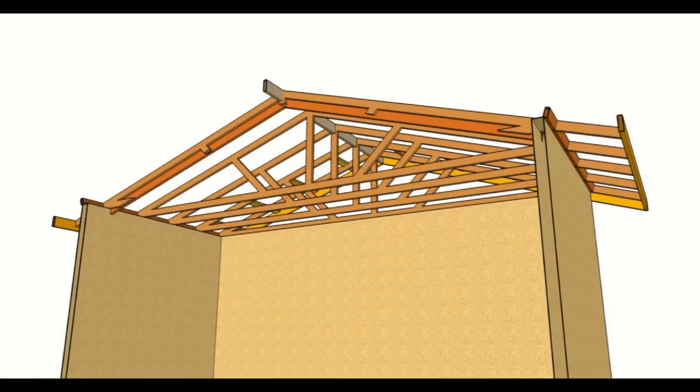The moment that you remove the bottom chord or the ceiling joist part that the ceiling drywall actually fastens to on the roof truss, you will be severely weakening the structure of the building. If you were just to build something like this without any additional support, you just went ahead and framed something like this, there's a good chance over time the load of the roof will put pressure on the center of the wall and actually start to bow the walls. It'll actually push the walls out, and the ridge, instead of being nice and straight, will actually start to sag. It will start to sink in the center. So the next video, like I said, will provide you with a solution for that.